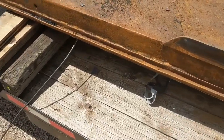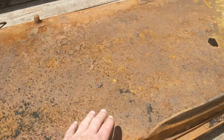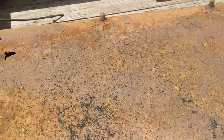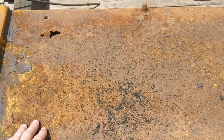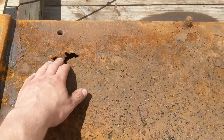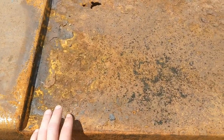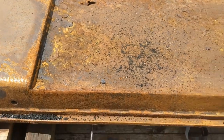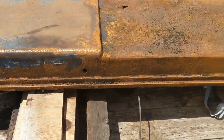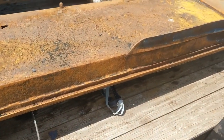The part that concerns me the most is right here. It had stainless plates over it with things that allowed it to move. I took those off and there's a good layer of rust. After chipping and beating on it with a hammer, I actually punctured through in two spots. I'm going to have to cut it out and weld in some new steel. But I'm hoping everywhere else I'll be able to clean the rust up. That big trench is for electrolysis.